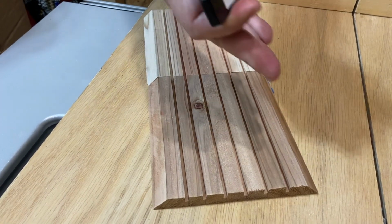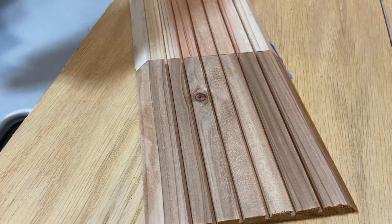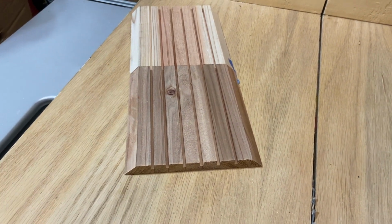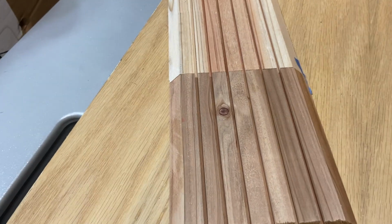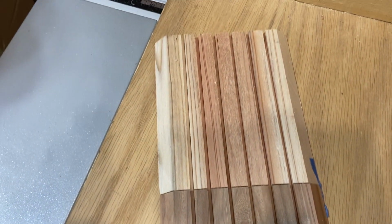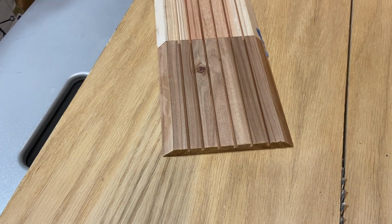And this can actually be a nice finish for something, right? I mean, yeah, for sure. So, you can make this kind of cut and you can have squares and all kinds of neat things happening. Makes a nice surface finish when you're looking to add visual interest to a piece. But for this, we wanted to just demonstrate that by attaching those two pieces together and doing the dados all at the same time, that ensures that they are all perfectly in alignment so that we shouldn't have any issues with our shelving.